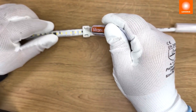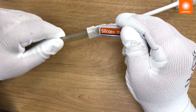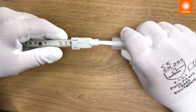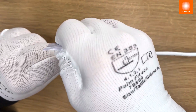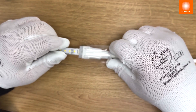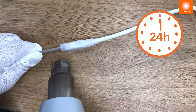Apply the silicone glue and press the cover on. Apply the silicone glue a second time and pull the protective silicone sleeve over it. Now put silicone glue here to seal the gap between the strip and the protective silicone sleeve. Finally, attach the shrinking foil and let it dry for 24 hours.